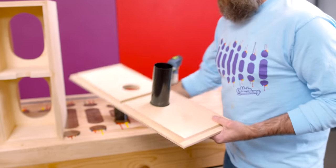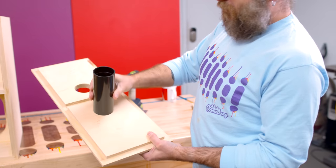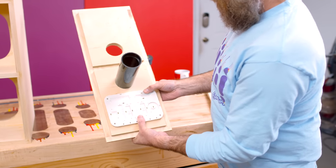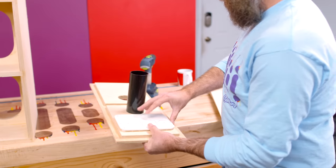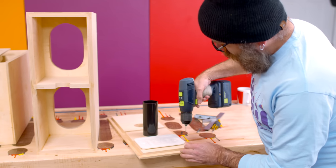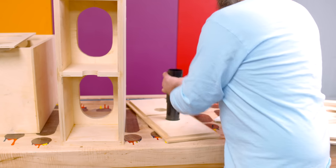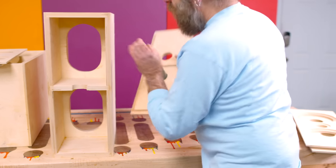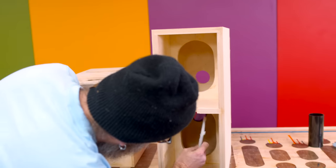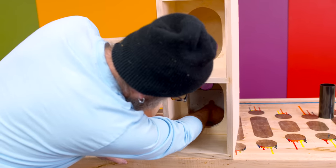The port tube will eventually go in there, and then this piece goes over top of it. Once you get the right length, you can tape or glue it into place. I'm going to pre-drill some holes for the crossover board before gluing this up, because that'll make things a little easier. I just need to drill deep enough without going all the way through, so I'll be able to get a screwdriver in there and mount it.